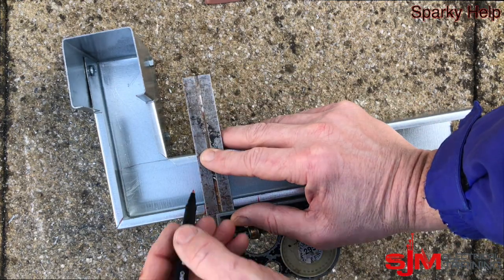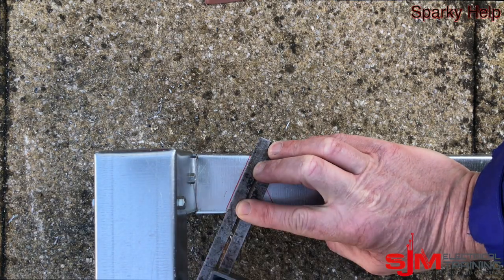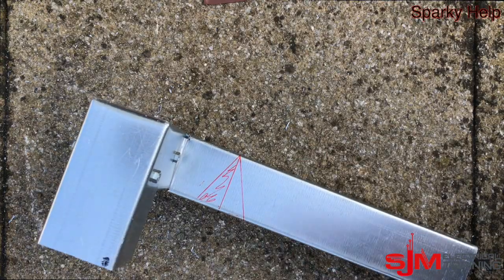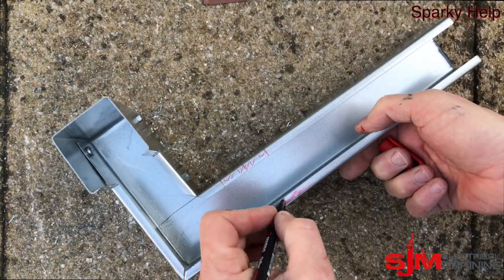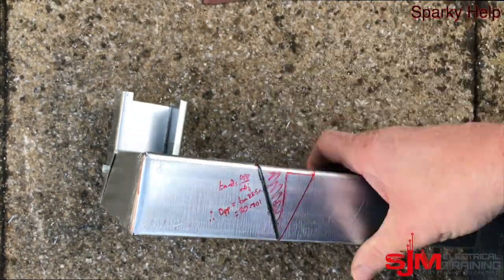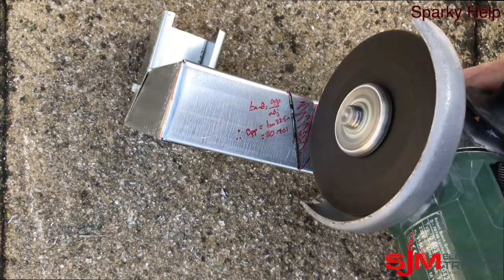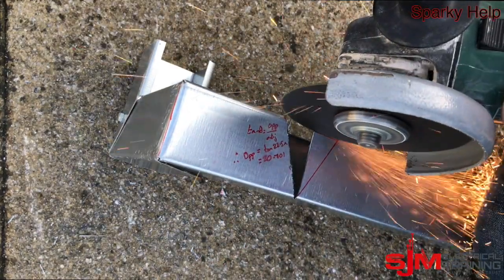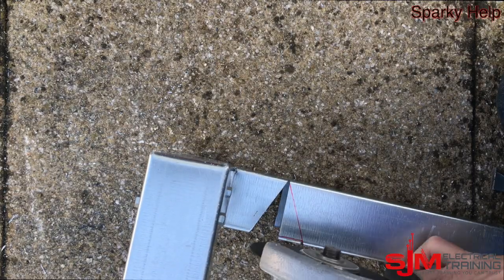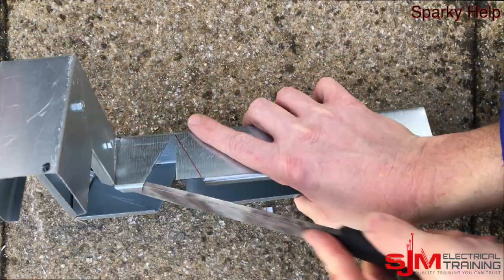And this will give you a 45 degree bend. Making sure you go the right side on both sides — a little bit tight, but we can get it in, it's not a problem. Normally I would do this with a hacksaw in class to show students, but this time I'm going to do it with an angle grinder. So those are the bits we're going to remove. Very carefully, without taking my thumb off, we're going to cut those pieces out. Making sure we don't cut beyond the marks, keeping as accurate as we possibly can, because it's going to make the bend look half decent. Remember there's a thin blade in. Carefully cut down those points, just those points, keeping at the angle that we're going down — those 22 degrees — otherwise if you cut down square you'll end up with a hole. Take those top lips off. Then give this a good file up; remember this is containment, it's here to protect the cable, so make sure you give it a good file.